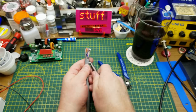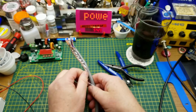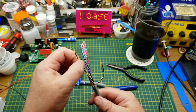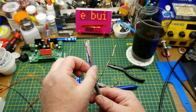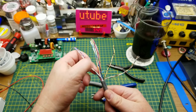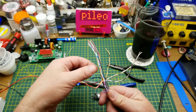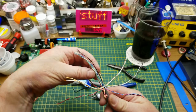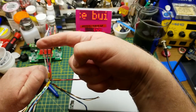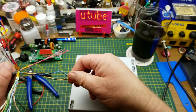There's the pull string — have you seen this trick before? That's what that string is in there for, ain't that handy? So now I'll separate these pairs to keep them straight. This is going to be a bit challenging because, as I've mentioned before, I am somewhat colorblind. So before I make any actual connections I'm going to ring it all out with my meter. There are going to be eight conductors for control lines and another eight, plus the bundled power conductors for the bench output.